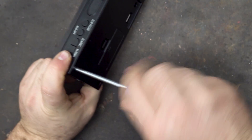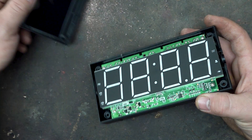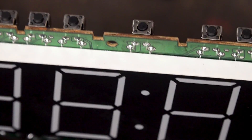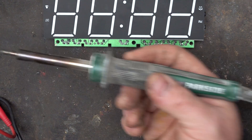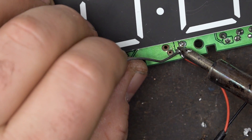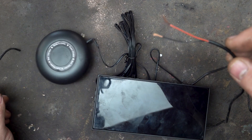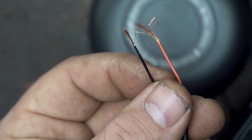Using a screwdriver I can take apart the alarm clock. I'm interested in finding where the snooze button connects on the circuit board — I can see under it there's a little button and I can take it away. I want to replace it using a soldering iron with 30 centimeters of copper cable. I solder them directly instead of the button — basically every time the two copper cables touch together it will close the contact and stop the alarm clock. Very easy!